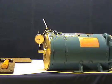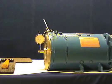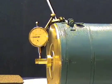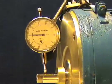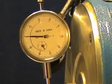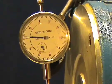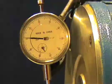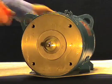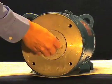Now use the dial indicator gauge to check for run out and wobble. The AV850 will operate even with a large amount of run out, but Avtron recommends run out be less than 4 mils or 0.1 millimeters for best performance. If stub shaft run out is excessive, use a pencil to mark the high side. Then, using either a dead blow hammer or by adding shimming under the mounting surface of the shaft, true the shaft. Measure again with the dial indicator to verify the shaft is true. Remove the stub shaft bolt, apply threadlocker, and reinstall the bolt.